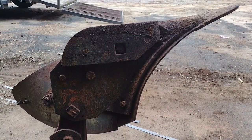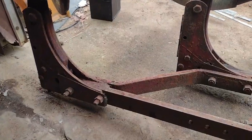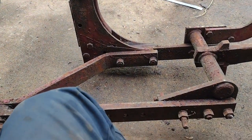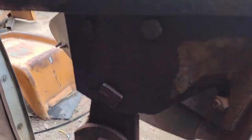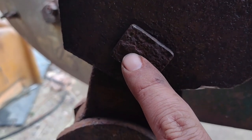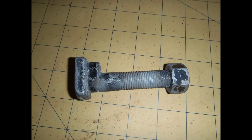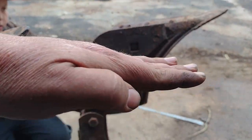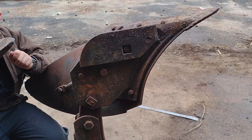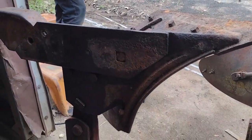Welcome — don't adjust your sets, we are upside down. I'm working on an International 215 plow — early to mid-production judging by the decals. You can see there's a little arrow on this nut; this is what they call a cam bolt. I'll put one in the description. I'm adjusting this plow for plow days. This one here is set aggressive — as you can see it's pitched — and this plow here I've set from aggressive to normal.